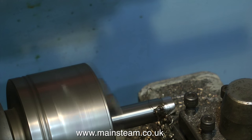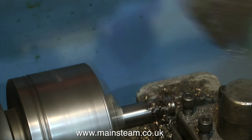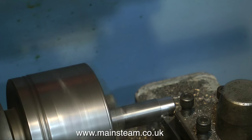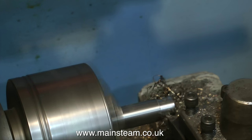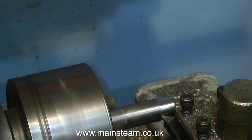One of the main benefits of using a collet chuck is that you can remove the part from the collet chuck and try it on the job, and then if it's not right, put it back in the chuck and it will remain 100% concentric. But this will not be so on most three-jaw chucks.